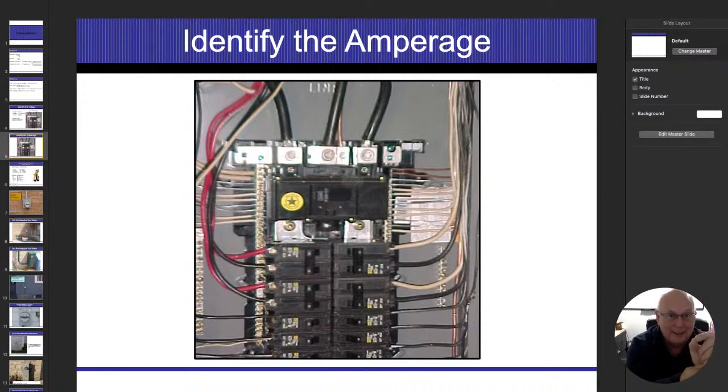And then we want to go with whatever the weakest link out of those items is. If that main disconnect that we're looking at here is not equal to or less than everything else, then it's considered dangerous, all right? That means we're going to allow more electricity to flow through one of those items that isn't designed to carry that much. Another item I left off the list is going to be our service entrance pipe and the size of that cable coming in there. I can't put too thick of wires inside of that either. So whatever our weakest link is, that's what we're going to be pointing out.